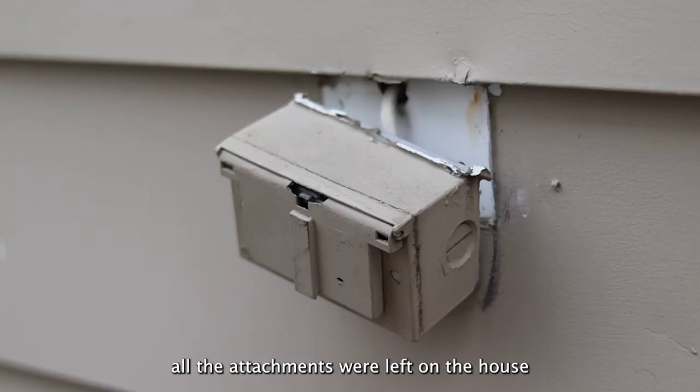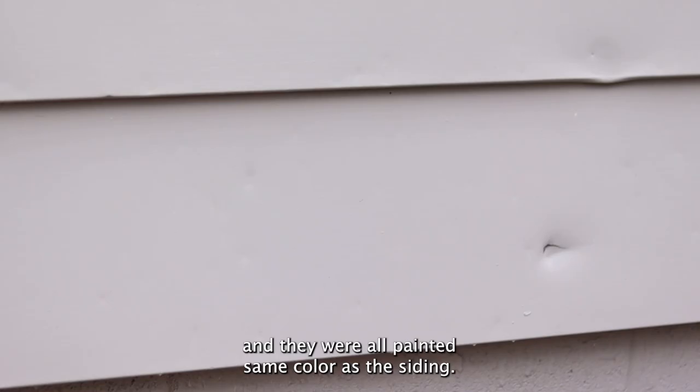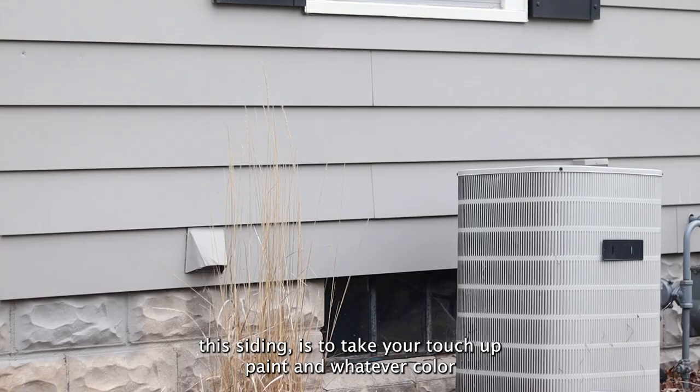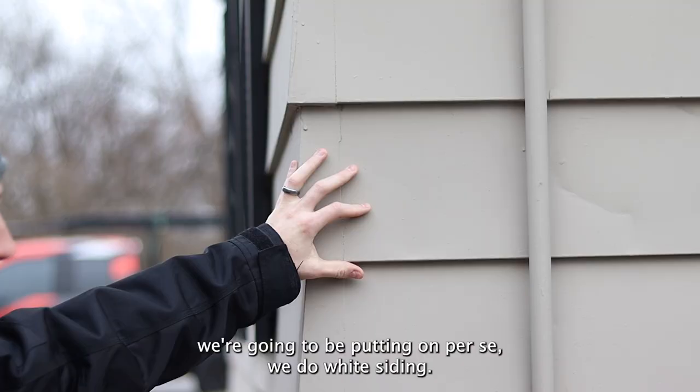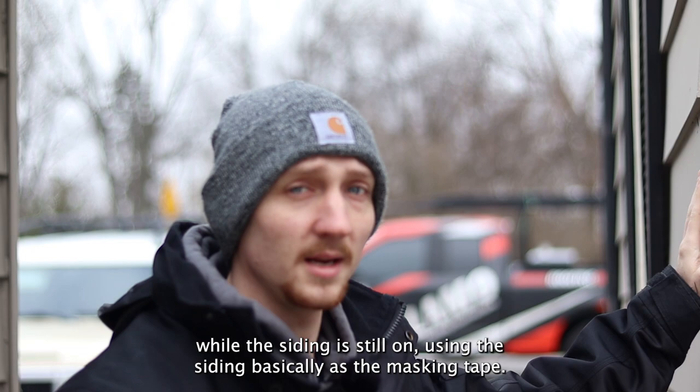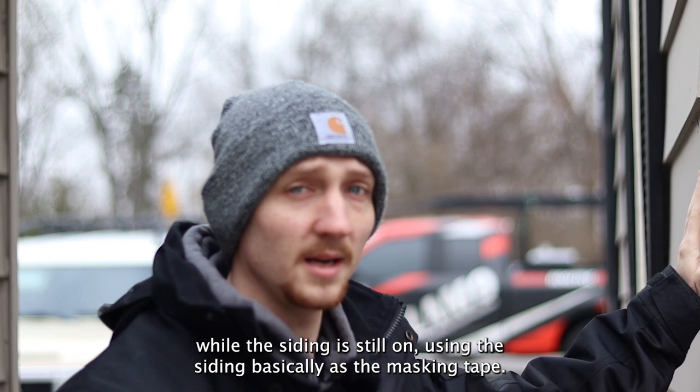When the house was painted about five or six years ago, all the attachments were left on and painted the same color as the siding. So the best thing to do, since we're already going to be replacing this siding, is to take your touch-up paint — whatever color we're putting on, say white siding, we'll use white touch-up paint — and spray paint all of the old accessories while this siding is still on, using the siding basically as the masking tape. That way when we rip it off and put the new siding back on, everything is matching and we don't have to worry about touching up paint on brand new siding or putting paper and tape all the way around. We can do that before we even start the tear-off process.